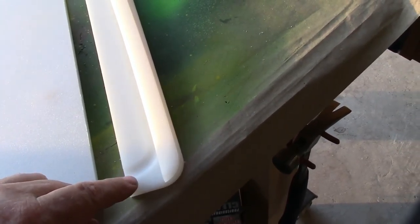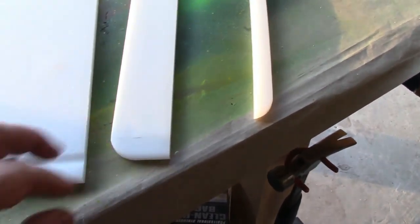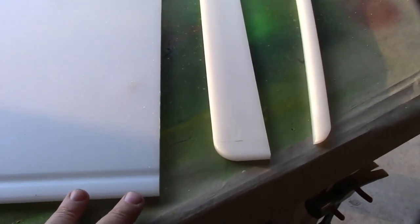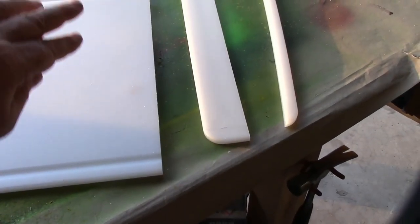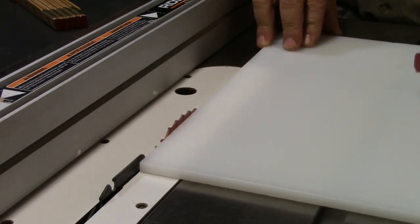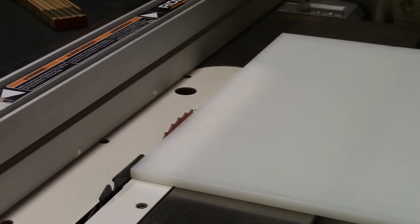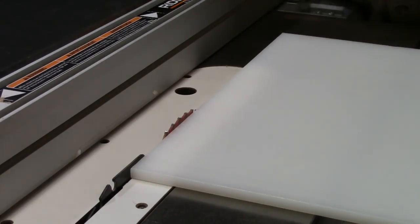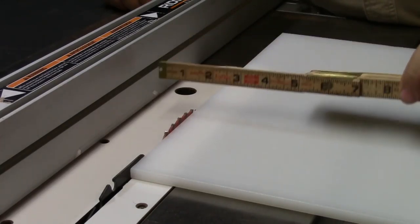And that way I'm not losing a good inch or so here that I would otherwise lose. Because once I turn this over to use as a surface, I've got these rounded edges which can interfere with the screw mounts that I'm going to put in. Then what I'm doing is cutting these into strips that are two inches wide, and the length of this board here is 15 inches. Here I'm going to cut this cutting board — part of it I've already cut off — and I set it so that the gullet of the teeth is barely above or below the cutting surface.